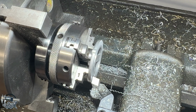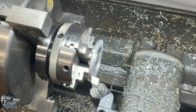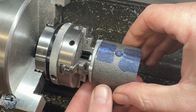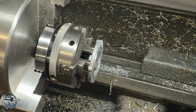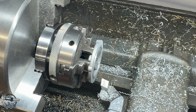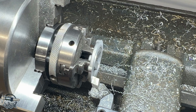Again, I'll do this off camera and I'll get you down to where we are with the final dimension. So I'm at 1.332 and we got a really nice fit on this. So that's perfect. That's what we needed to do. But we were only at 25 thousandths deep and we had to go to 31 thousandths, which, because of setting up a dial indicator, is easy to do. So let's do that.